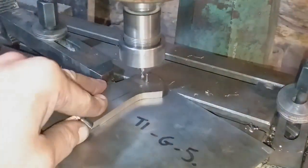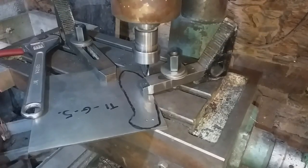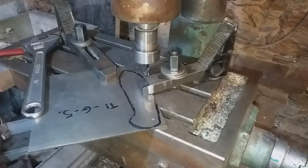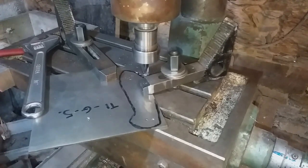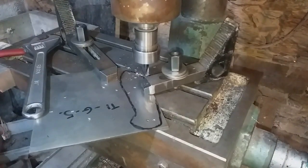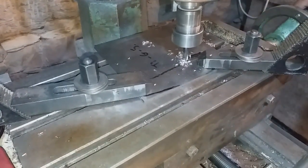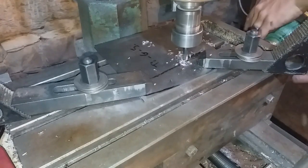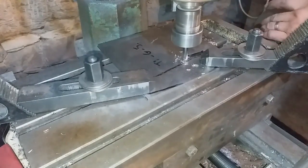I then used the frame lock side as a template in order to get a precise match for the alignment for the stop pin. And then I'm back onto the milling machine again for trying to cut the 2mm thick titanium profile away from the main plate, and then a very quick rough profiling of that side. It'll be tidied up later to line up with the lock side.